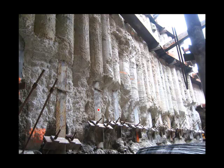This is the exposed H-pile that was cast into the secondary hole; the concrete in this area has been removed in order to get at the H-piles and install rock anchors. This is a nice illustration of a pair of rock anchors — one on either side of the H-pile. Rock anchors are extremely helpful because they free the site of any pipe struts or bracing, giving you an unobstructed area to construct your new structure.